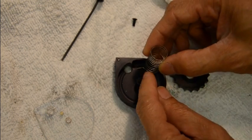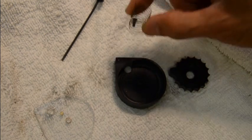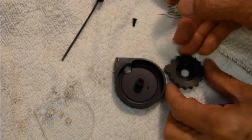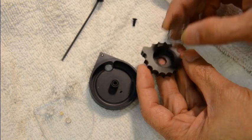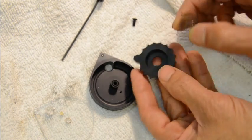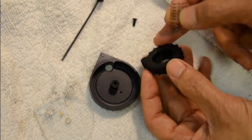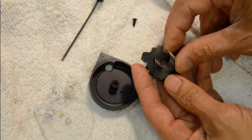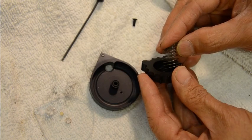One end is pointed when it's curled up and bent. This end is facing down and goes into your rotor. The rotor has a front side and a back side — the spring goes in the back side. There's a little pin hole where the big tall notch is, and you put the spring end inside there. It's a very small hole, you have to fish for it.